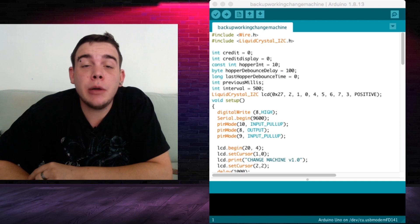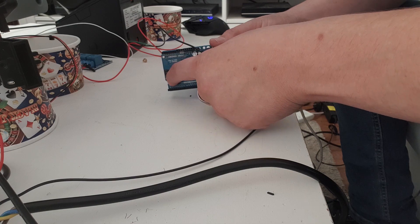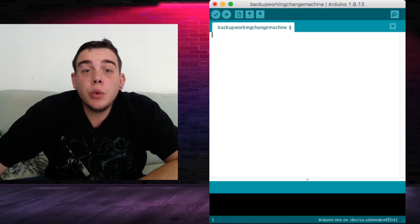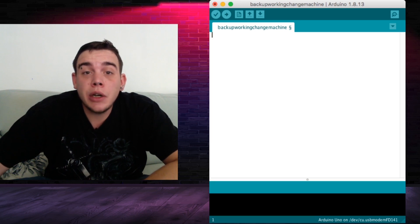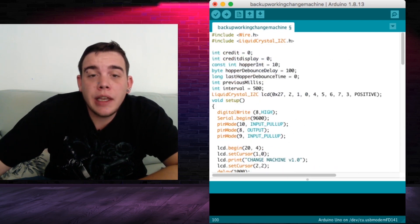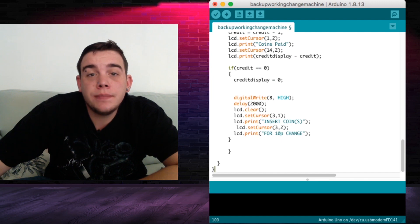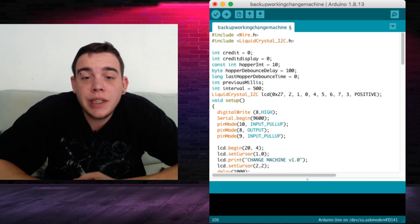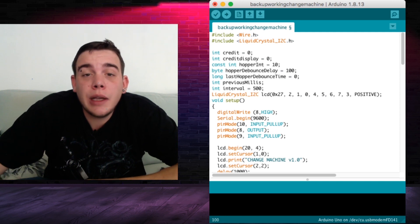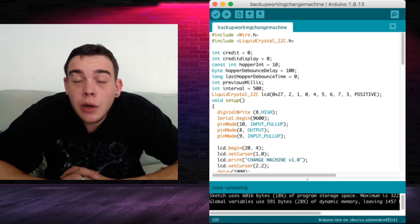At this point hook up your Arduino — if you need help setting up your Arduino for the first time, there is a help video available. I've hooked up my Arduino to the computer and we've got the green and orange lights all set up. You're going to want to copy and paste the code I've included in the description. Once you've done that, your first line should be #include Wire.h, and you should have four closing brackets at the bottom. Don't worry about anything else in the code environment — just hit upload and that will upload the sketch to the Arduino.